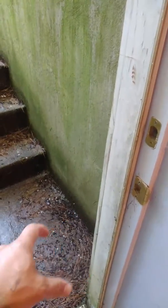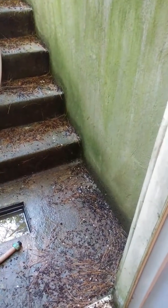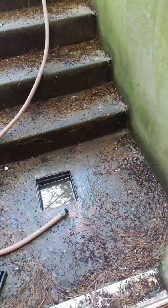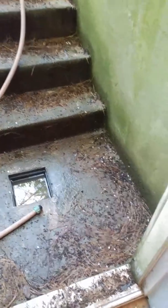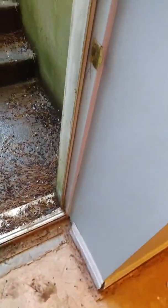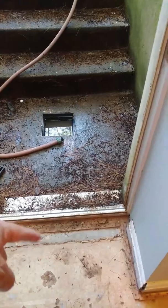What we would do is put a trench drain in here. These things are graded a little bit and some of it still runs this way. We'd put a trench drain straight across right here so that any water coming down the stairs or on the walls gets right into the trench drain. The trench drain drains through the threshold — yes, there's a foundation wall there, but you're going to have to go through it.